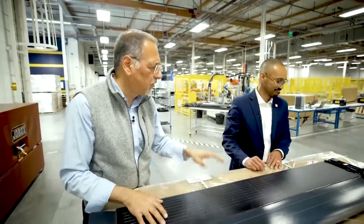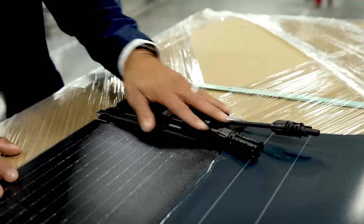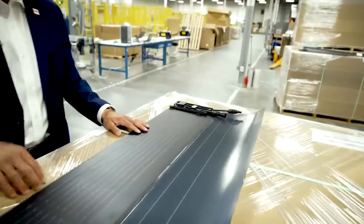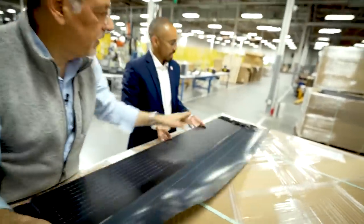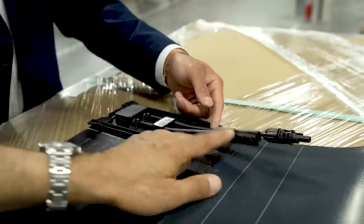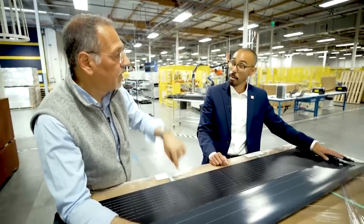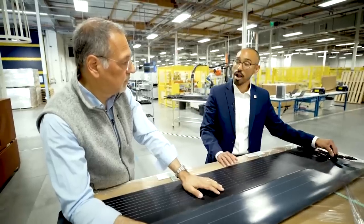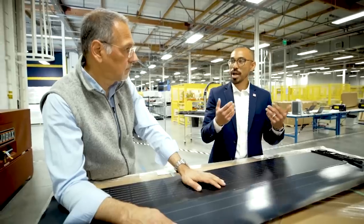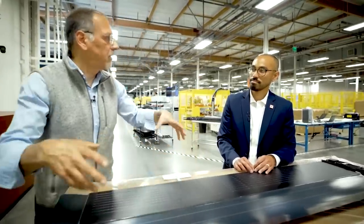For the solar geeks, the wiring connects up the roof and then daisy chains all the way to the top. The connections stack up the roof like overlapping shingles, which makes it very easy to pinpoint wiring if you ever need to service them — they're not buried under something you'd have to rip up. Everything connects at the top and lands into a central string inverter on the side of the home, as opposed to using micro inverters at each panel.